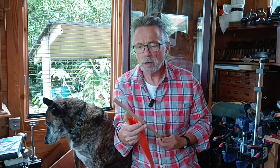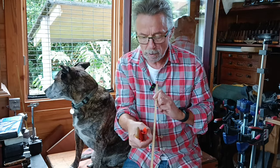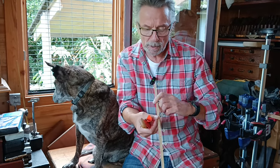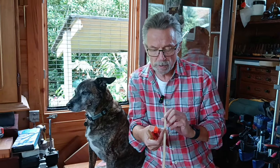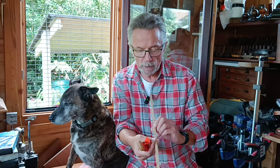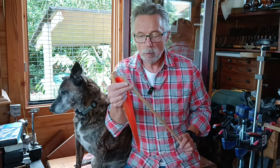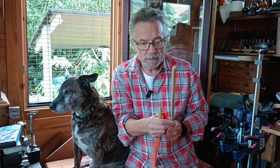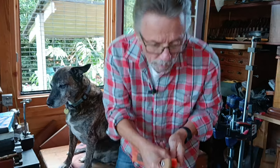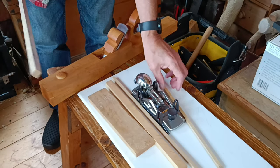In order to get exactly the right sizes, I've brought this one down and marked on here — you probably can't see it — all the sizes. I've gone along here with a micrometer and I've got 7.9, 8.5, 7.8, 8 and so on. So this piece is pretty well out of whack. But it's now very long and relatively difficult to hold. So what I've done is I've created a jig where I double-sided tape the piece.